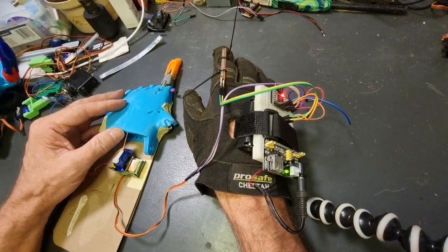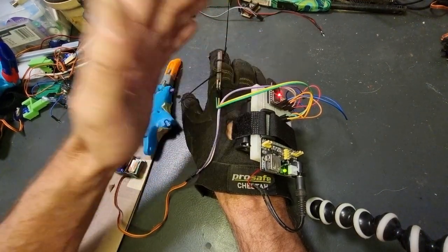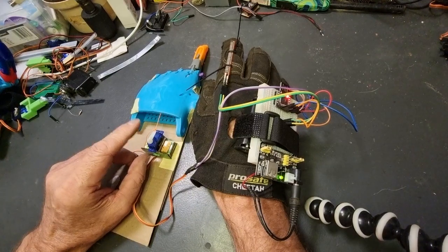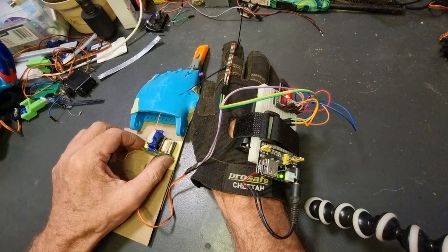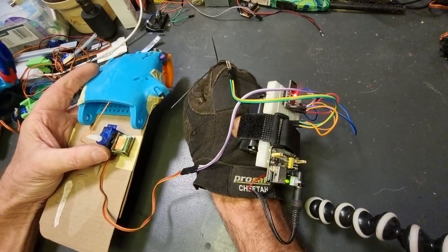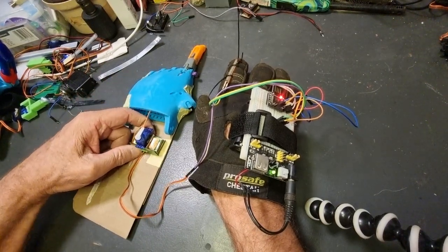It's pretty straightforward code — if you can work with Arduino code it's easy to follow, and I'll post a link to everything. The Arduino model I'm using is an Arduino YUN, and the small micro servos I'm currently using have plastic gears, but the next version will use metal gears so they won't strip. The plan is to set up a build with five servos running each of the fingers and a sensor on each finger, giving us a fully operating hand mirrored from the other hand — hopefully that will be in the next video.